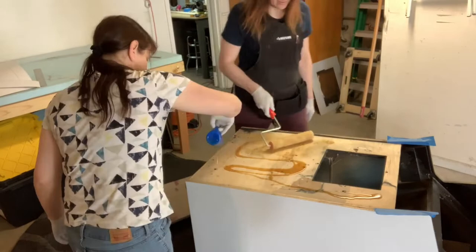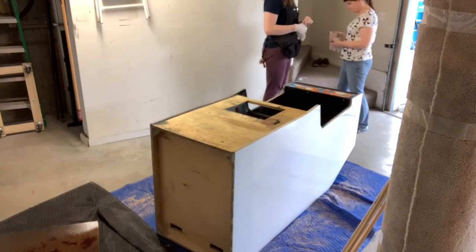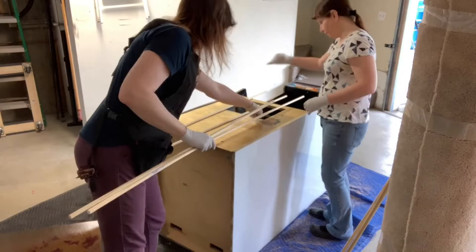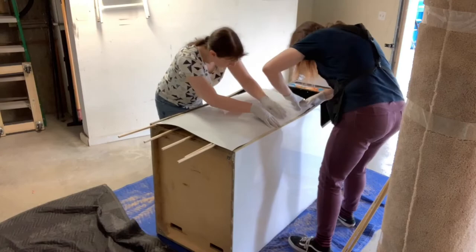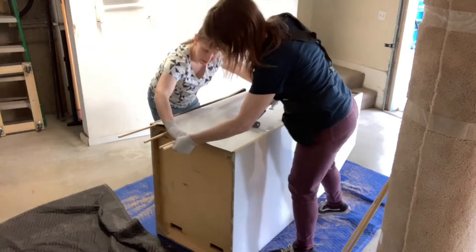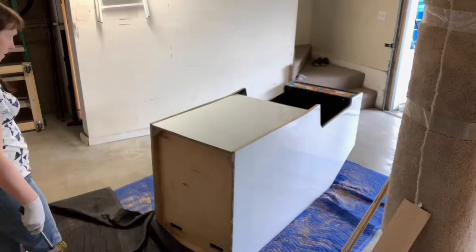Applying the laminate adhesive again, spreading it thoroughly and getting into those corners as closely as possible. About 10 to 15 minutes after the first coat, put the second coat on, then wait another 15 to 20 minutes until it's tacky before putting the laminate on. We had our dowels again. This section was a little tricky — we didn't know quite how to approach it because we wanted the edges to be perfect, so we aligned the inside edge first. It actually worked out really well, though one corner didn't quite go in as we wanted.